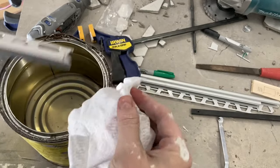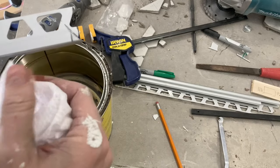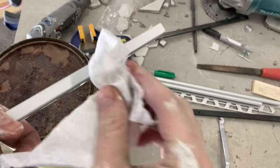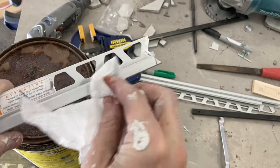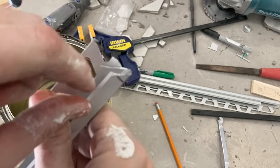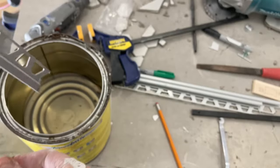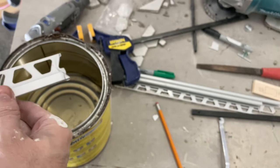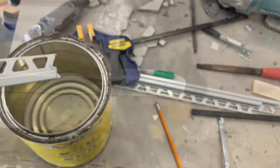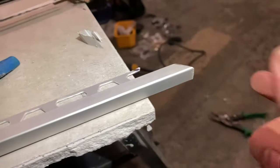By the way, this is aluminum. If you're dealing with stainless steel you're fine, but if you're installing aluminum in a wet shower setting you might want to think about coating it with some special fiberglass or metal type coating. I'll put a link in the description for this stuff - it's basically clear coat for fiberglass and metal. I just kind of dip it in there. Obviously you want to test this first to make sure it doesn't stain or do anything crazy - dip it in, rub it on the outside, let it sit for a week and see if it does anything.